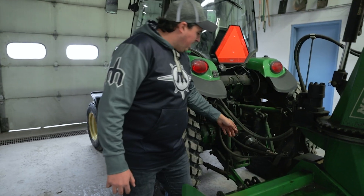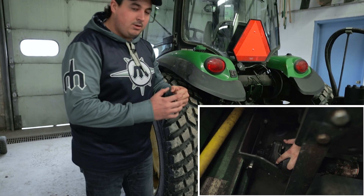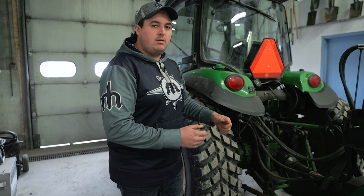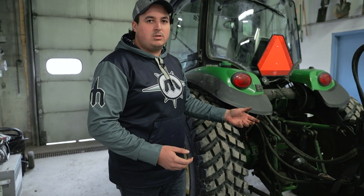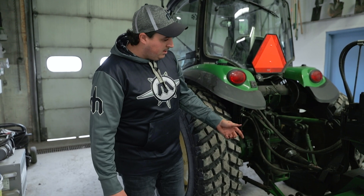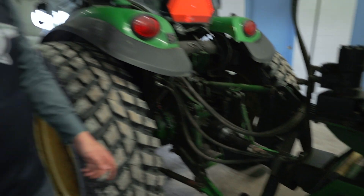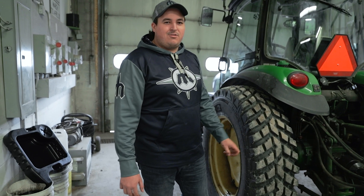On your tractor here, you have two very important pieces — the PTO knuckles — and that's just to keep them lubricated because they're always spinning and always at a different angle. If you don't let them get the lube they need, they can bind up or you're going to have wear and tear and have to replace them all that much sooner. There's also another piece just right in at this black box there — just needs one or two shots of your everyday grease. That's basically your maintenance for the blowers.